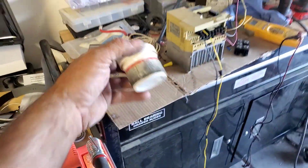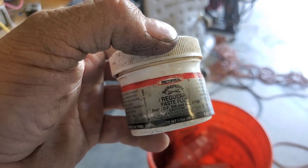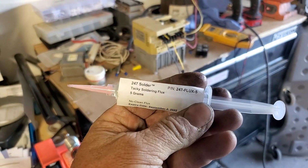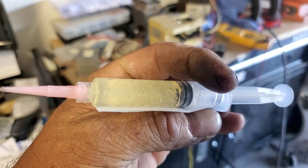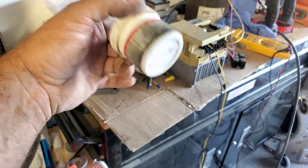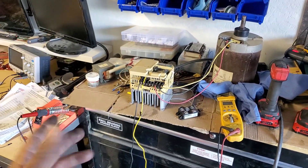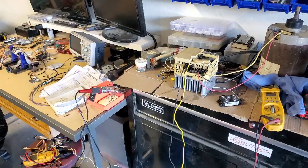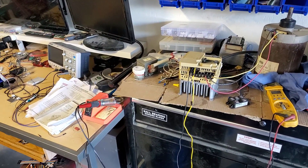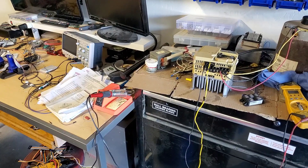In case this is just what happened - I used this flux to solder the wires to my capacitor. Maybe this stuff is kind of conductive. This is what I used on circuit boards, which is made for circuit boards and it's pretty expensive stuff. But I was being cheap and used pipe solder flux instead. It's probably not going to cause problems on just a wire at high voltage, but with it all on the capacitor it kind of bridged the connections. I think maybe it built up carbon. It didn't short right away - it shorted after a while. Anyway, who knows. Until next time.